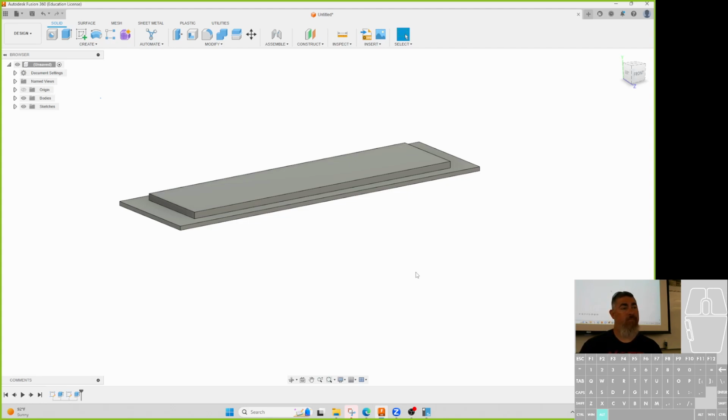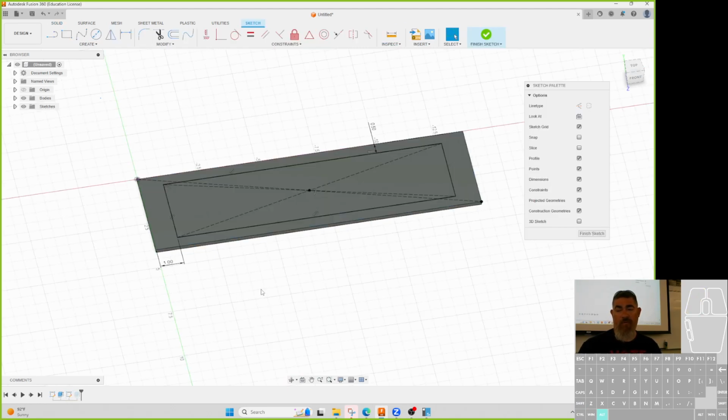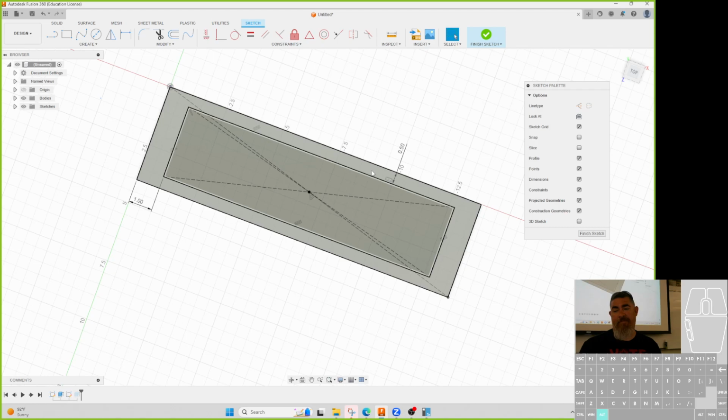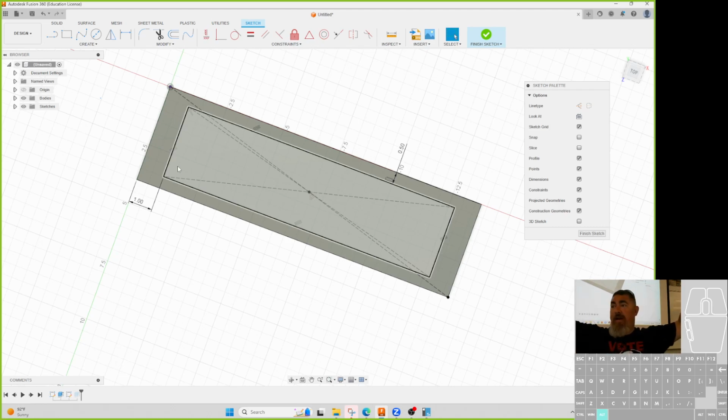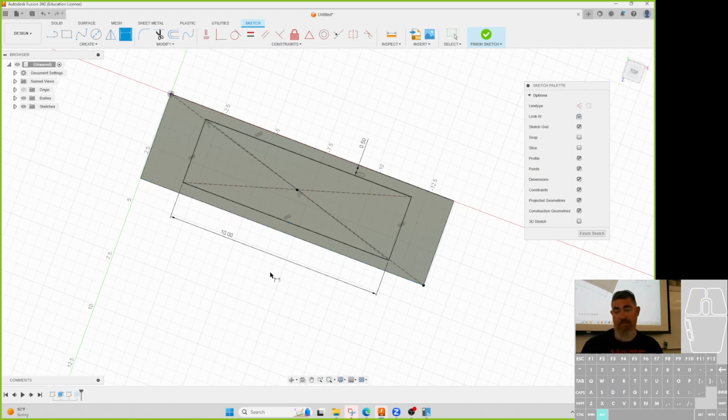So you would do those lines if you didn't know the measurements of the sides? It depends on what I want to be important. So if I want it always to be 1/2 inch from this edge and always to be 1 inch from that edge, then I put those in. If I know that I always want this one to be a certain measurement, then I put this dimension. So kind of like if this is a lid for a box and I want the overhang to be 1/2 inch front and back and 1 inch on the side, no matter how big I make the box, then I would do it this way. If I cared about this needing to be exactly 8 inches, then I would dimension this. Because then I could go here and say I want this to be 10 inches. And now this is always going to be 10 inches no matter what this changes to.